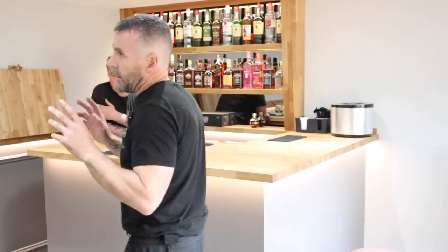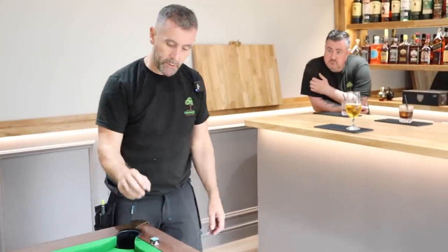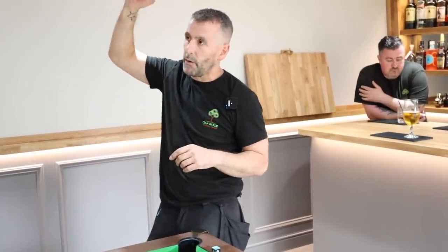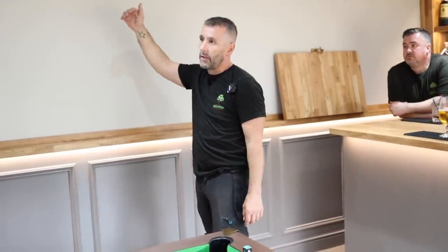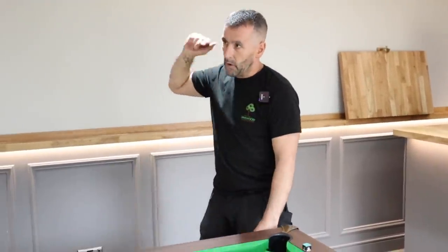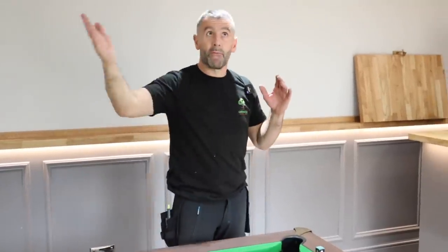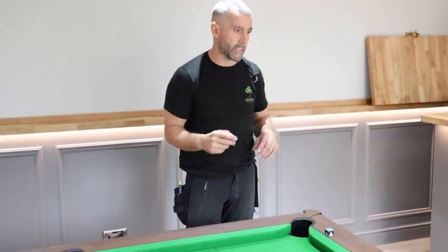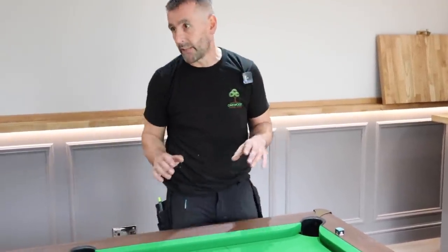The customer wanted a family room, bar room, chill out room — so it's six metres long and four metres deep. In the ceiling, if you've watched my other videos, we put flitch beams on. The reason why we put flitch beams is the ceiling span is four metres, there's some massive conifers at the back and we've got astroturf on the roof as well — someone is going to be walking along there cutting the conifers down. So every other beam is a flitch beam, which is basically two 5x2s with a piece of steel in the middle, all bolted together.